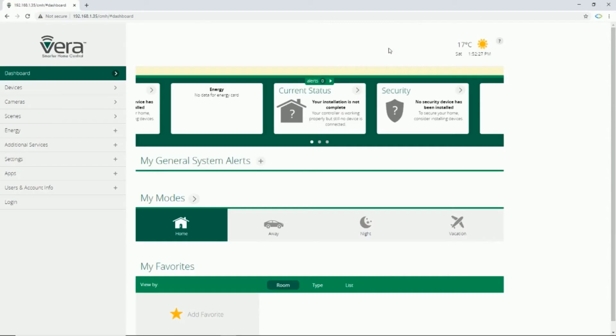Stay with me. After connecting the Z-Wave module to the door lock, in order to add this model to Z-Wave network, you have to enter your gateway into inclusion. While your gateway is in inclusion mode, by entering your door lock into inclusion, it will be added to the gateway. The procedure for entering the door lock to inclusion mode is simple. In another video, which its link is in description, I showed you how you can add this device to advanced mode.